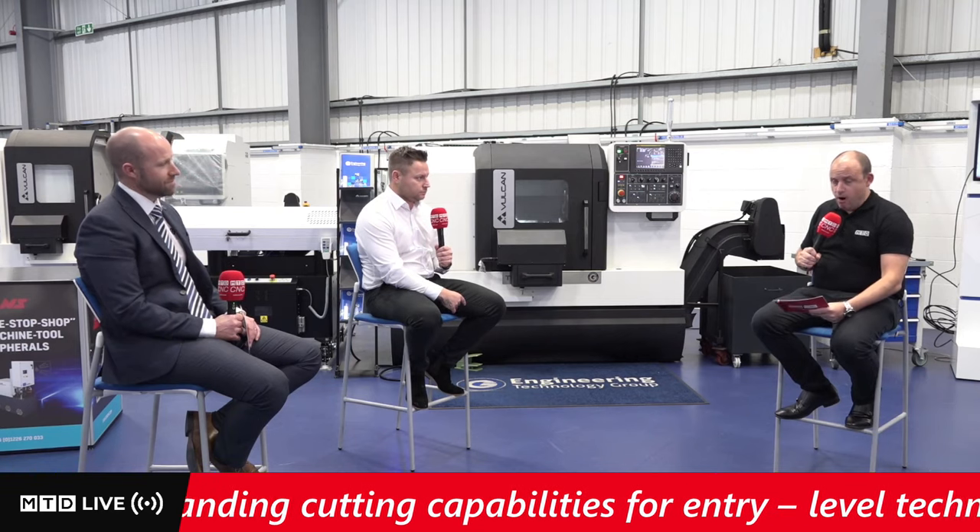What would you say so far about what you've seen using this strategy on this machine? We've tested it this morning and seen the load come a lot lower than expected. Normally it's good when you're around the 60% mark — keeping it in the green-amber area. On a good machine the X-stroke load is quite low, which is what this machine is showing. If the load were higher, you'd tend to reduce the cut and not be too aggressive.